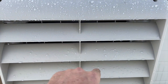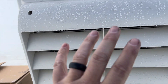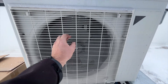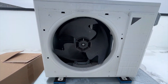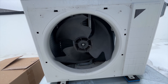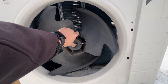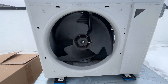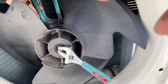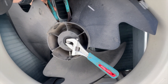First things first, we got to take this off — it'll also take the cage off. There are four screws, one in each corner. The cage will come off, then we'll take the fan blade off. Make sure you kill the power. Normally the fan blade holds it in place, but we can't do that here. So I'm going to use channel locks to grab the back of the shaft so it doesn't spin when I loosen this. If I don't do this, the whole shaft will just spin because the middle of the fan blade hub is bored out — and because of that it eventually unscrews itself and gets stuck again.